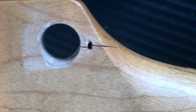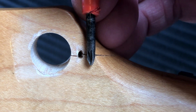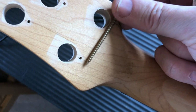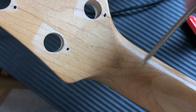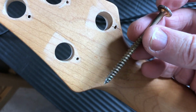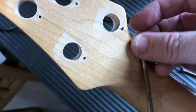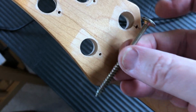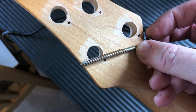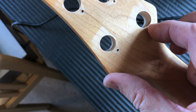Let me just talk to myself and you. I'm going to have to drill the hole about there. Right, bugger. All the screws I have got the grip right across it. They don't have the head on it. So for example, here's one here, which I'm not going to use, obviously, but it's got a clear section with none of the threads on it there, so the threads on this small narrow screw would go there, and then the wood biting into there would pull that in.